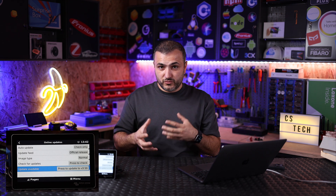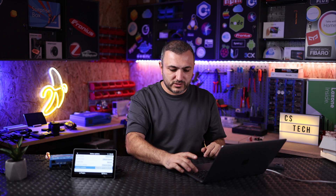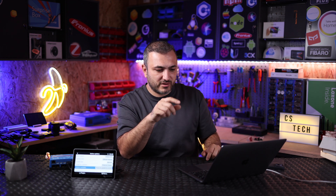What is the main difference between these two versions? The first main difference is that version 3.5 no longer uses screen mirroring. As you can see right now, if I move something on my Mac on VRM it also moves on my screen, which is very resource and power consuming from your GX device. The system had a VNC-style viewer between your display and your web interface, which made it work very slowly. With the new version that's gone, so the system will navigate menus very fast. Keep in mind what's happening in real time on your GX will still be reflected in your system, but you just won't see what's happening on your device if you move from the web. Let's hit update - this update takes around three minutes.